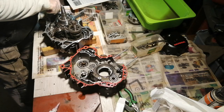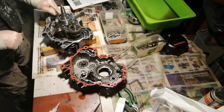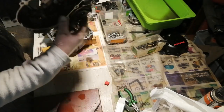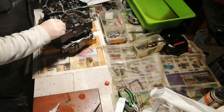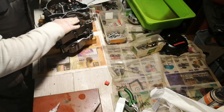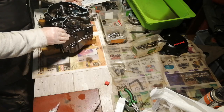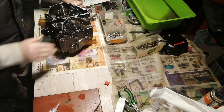There you go — the right way around. I apologize to anyone watching who knows how to do it properly and was screaming at the screen. I'll try again. Fortunately you do have a few minutes with this silicone — it's not that fast setting. You don't have hours but you've certainly got a few minutes. Just gently press it over — there are rubber seals where the shafts go through the outside of the casing, so there's a little bit of resistance. Then the two locating dowels should make it go clunk.